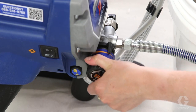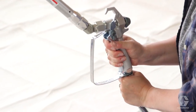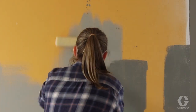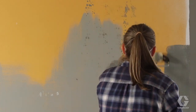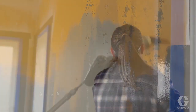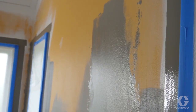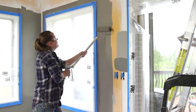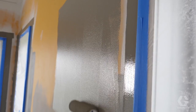When using a pressure roller, turn the pressure to the lowest setting where the sprayer turns on when the gun trigger is pulled. Now we'll need to get the paint to the roller. Pull the trigger and roll on the surface. You'll see the paint come through the perforated roller cover. Continue to hold the trigger open and roll on the wall until the paint is evenly distributed on the roller cover, then release the gun trigger and only pull the trigger when you need to apply more paint to the roller cover.